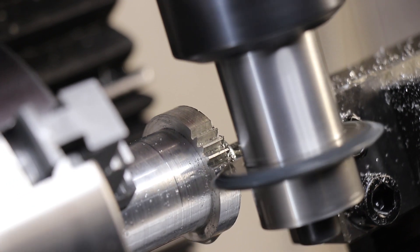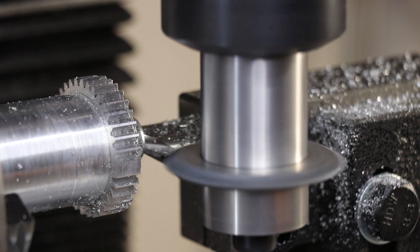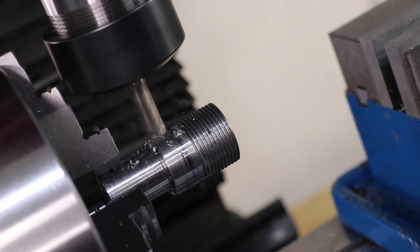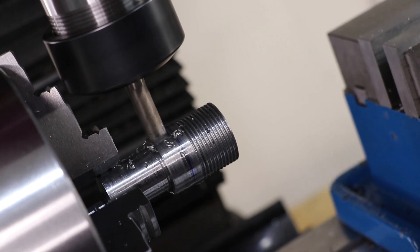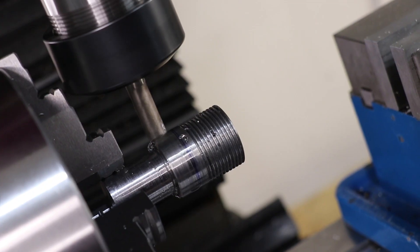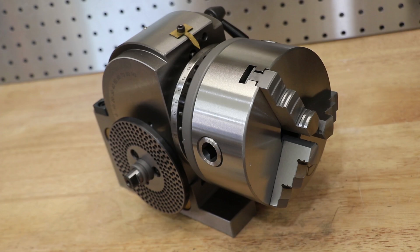Though of course there are quite a few other methods. As well as that, this dividing head can't connect to the table lead screw, which is a feature used to cut helixes and helical gears. I know there are workarounds, but as stock, the only gears you'll be cutting on this one are spur gears and bevel gears. However, these gears can be pretty useful, hence why I bought it. Plus, being able to do simple indexing with the 24 hole pattern is pretty invaluable.